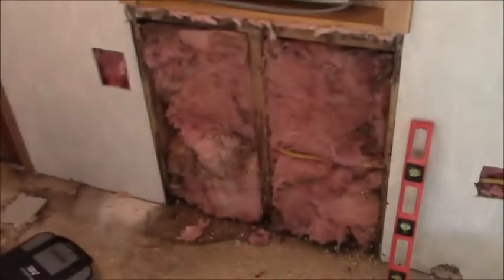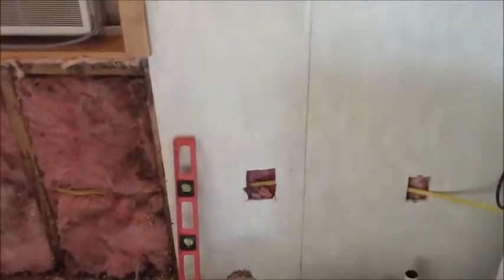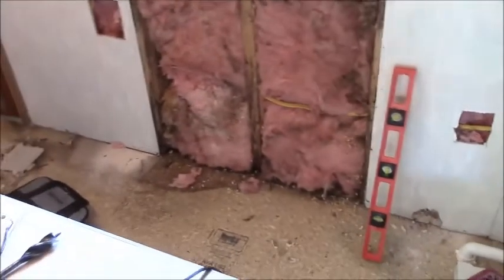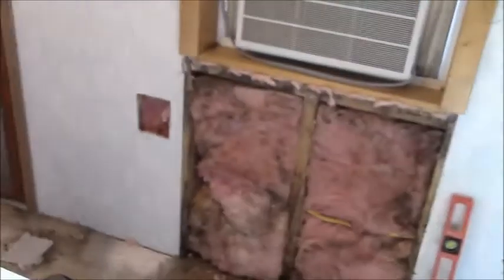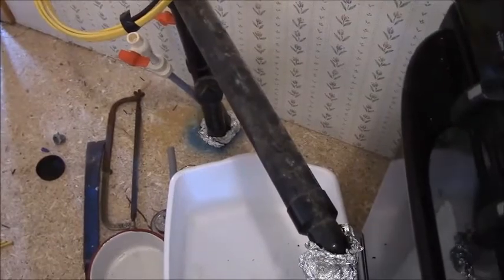So the countertop is going to cover all this stuff here. I'm going to fill this in with 1/4 inch plywood, and the two squares I cut out I'm just going to replace, taping them up with duct tape, because they're going to be behind the countertop anyway, and that's just to keep drafts, bugs, ants, rodents, whatever out. Alright, so that's our progress. Pretty soon we just have to make a patch around these pipes because they're really wide open, and then we can fix them.